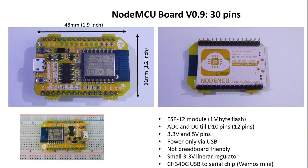The next in our row is the NodeMCU version 0.9 — I think it was the first NodeMCU board available. Pay attention: it uses the ESP12 chip which has only 1 MB flash and 6 pins are not connected to the outside. From a pins point of view, it does not have much more than the Mini NodeMCU, but it is much bigger and unfortunately not breadboard friendly. You do not get any free holes along the board. Today, this board is definitely a no-buy option.